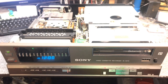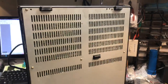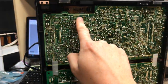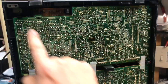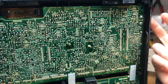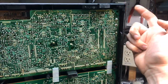We're going to replace them and adjust this thing so it works again. The first step is to take off the bottom panel. There are two boards here and the board we want is opposite the cassette compartment, so it's up here. Your capstan servo is labeled right here and your drum servo is over in this general area. To get this board out, you've got three screws and then three retaining clips up top. But the problem is your tracking control knob over here is going to get stuck, so you actually have to take the front panel off. There are three screws on the top side of the front panel and it will hinge off entirely.